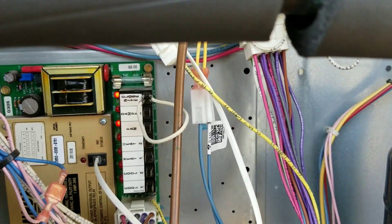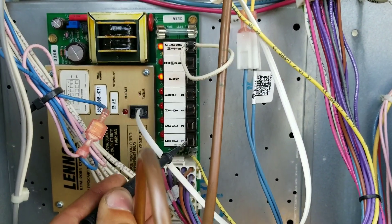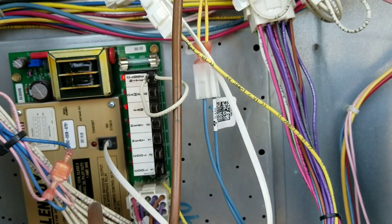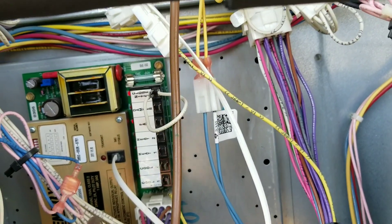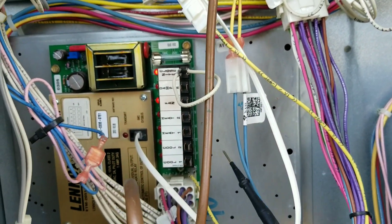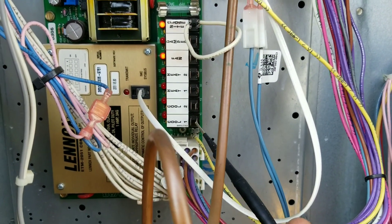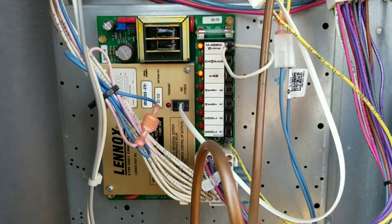So right now what I'm going to do is wire up that thermostat. I have a red wire hijacking the 24 volts off of this, and then it's going to go through the thermostat. And then because it's warm out, it's going to come back through the yellow Y1 wire and land on this side of the relay, essentially closing this relay and kicking on our cooling circuit.